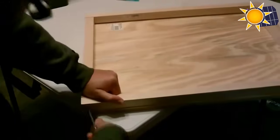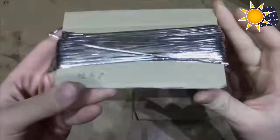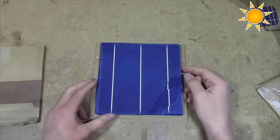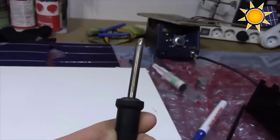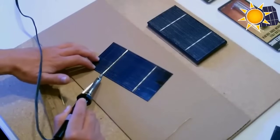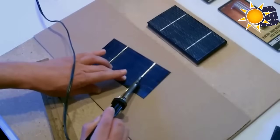Adequate airflow facilitates the soldering and encapsulation processes. There are many ways of acquiring solar cells — platforms like eBay simplify the process. Ensure you select cells with a watt rating that aligns with your energy requirements and available space. Soldering cells together to form an array requires attention to detail and proper technique. Techniques like tabbing and stringing help optimize energy production and minimize shading between cells.